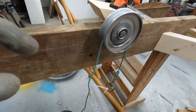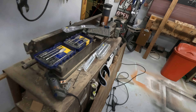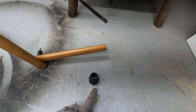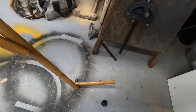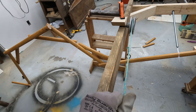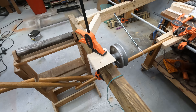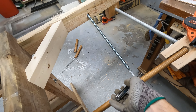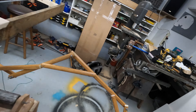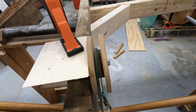Both go slack for a cycle long enough to let the leg trail back naturally. I'm bringing a couple new things into the equation: springs. I got some at a flea market. I'm probably gonna put rubber feet on the bottom too. I got a spring here — when you lift it, it moves pretty quick. That spring was a cool idea, but it was too indiscriminate on how fast it went. So I just used a hole saw to cut out a hole and made a little prototype pulley — and that sucker works.